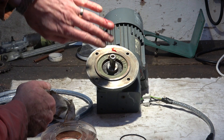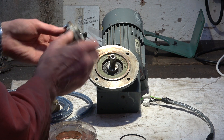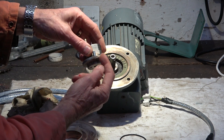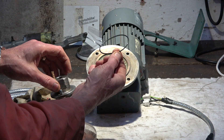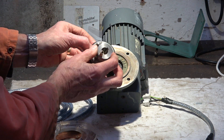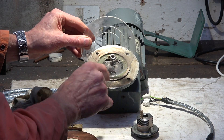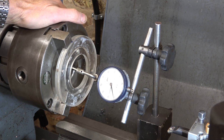I've cut myself — how do I cut myself so easily? I've been in here five minutes. Anyway, I drilled a hole through there so it's cross-hole drilled now, which means there will be a proper flow. But I was still concerned that air was going to leak around the sides, so I ordered a 58mm o-ring which just goes on there, just over that ledge and edge. What I'm going to do is machine a small recess in here to take that o-ring, and hopefully that will provide a gas-tight seal.